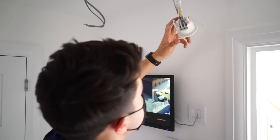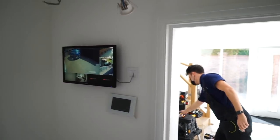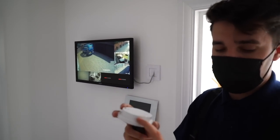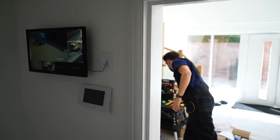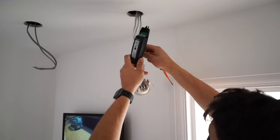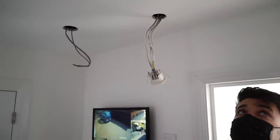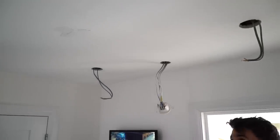In this room they want the Lutron occupancy sensors. I've got one here - really easy to wire up, in fact there are no wires on them. They link wirelessly to the Lutron controllers. We're going to fit one up here because we've already got the loop in and the loop out, so I'll wire that in and put it above the ceiling, then swap all of these out for our JCC V50s.